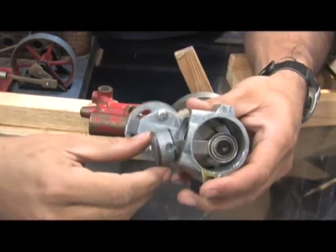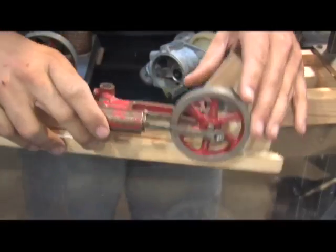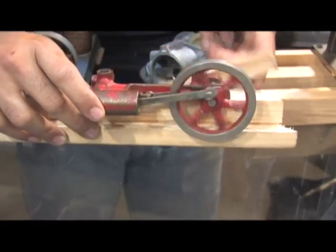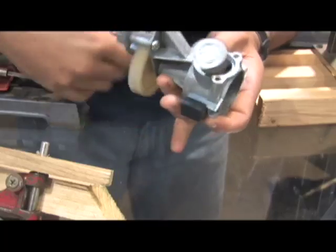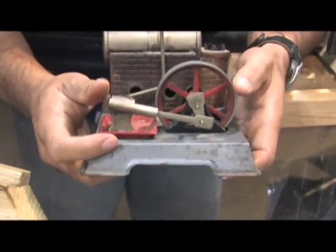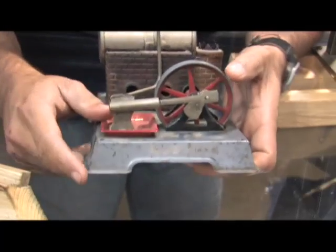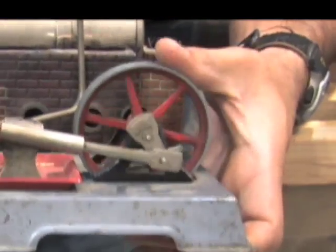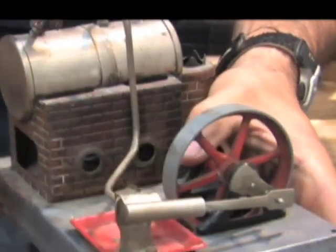One note about the piston inside: this particular engine has a swivel on the piston, which allows it to stay straight within the cylinder as the rod turns around the flywheel. You can get similar parts from a standard compressor. Now this other engine does not have that — the rod is fixed to the piston with no swivel inside. What happens instead is the entire cylinder moves up and down. Because it moves up and down, the slide valve is fixed and there's no extra arm with an extra slide valve like the other engines had.